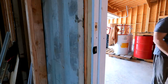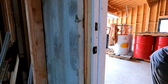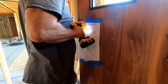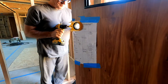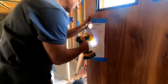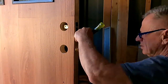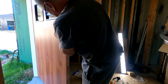Moving on to the deadbolt - I already did the deadbolt holes in the door, now I'm doing the striker plate and deadbolt plate on the frame. In a second you'll see the door lock and it works. The entry door is a little bit different - the template is different, it has a handle that is pulled. It's a little more ornate but very simple. We did a modern kind of touch on it. It requires one bolt hole near the bottom of the template and everything just lines up - it's kind of nice. They provide those templates.